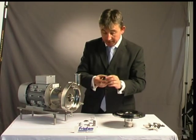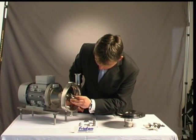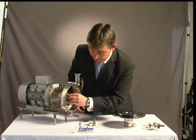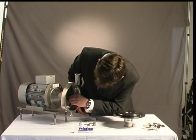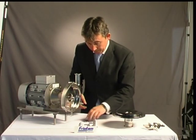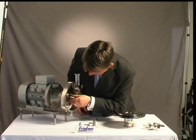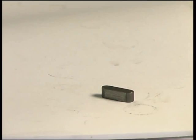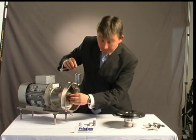Next thing we need is the rotary seal. So, the rotary seal — that's going to go on next. If you're doing this with a new unit and a new seal, I'd recommend you put a nominal amount of grease on the O-rings to ease them going on the shaft. And we've got our spring to go on — that's the spring on. And then we've got our tappet, which the impeller pushes against, so we just need to locate that in the correct place. That's it. Then we need to put our key in — just put that in there. Key in, simple.